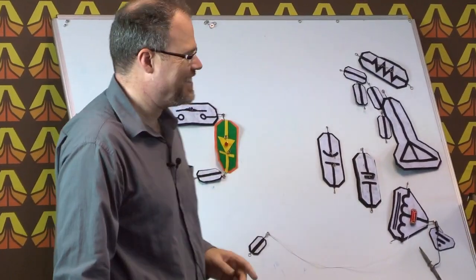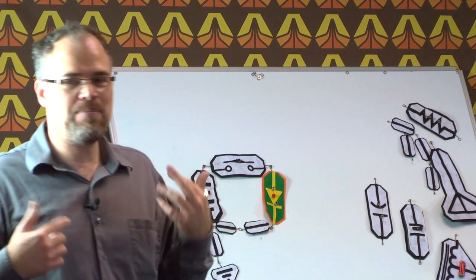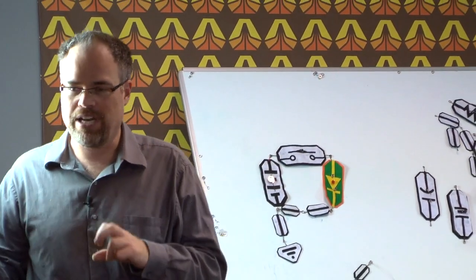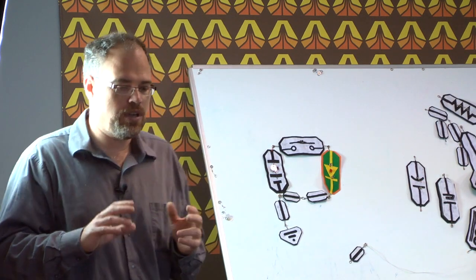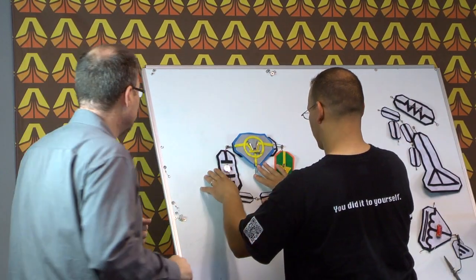So the transistor is really critical. It's a switch, right? In order to get it to turn on, you've got to put a little bit of current into it. But there's a little bit of a snafu. Nothing happens until you get the voltage up to about 0.7 volts. And then it goes through a period of high gain. And if you get too much voltage in it, it's saturated and changes you make don't really make changes anymore. So a transistor has a sweet spot.